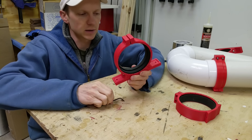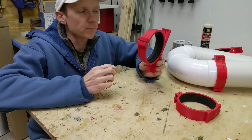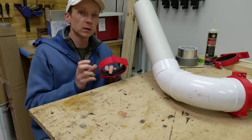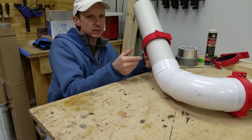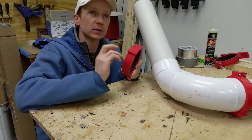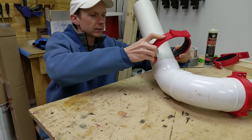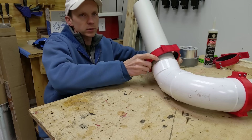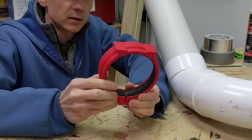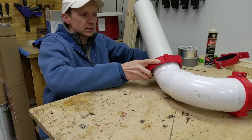The reason it's designed like this is so that everything is accessible from the front. If a clamp was already on a pipe on the wall and I wanted to add a mounting bracket, I could do that and still get to the screws. These clamps work great when slid on from the end, but another requirement I had was being able to install these on existing pipes without having to take apart the system that's already mounted. That means the clamp needed to open up far enough to go around the pipe. In order to accomplish that, I had to add splits around the outside rings, which makes this flexible enough to open wide enough and allows me to install it on existing pipe.